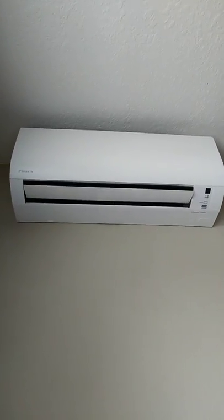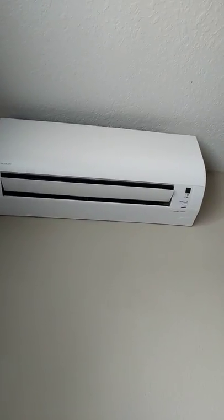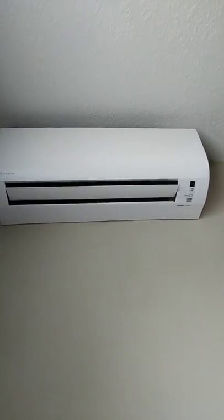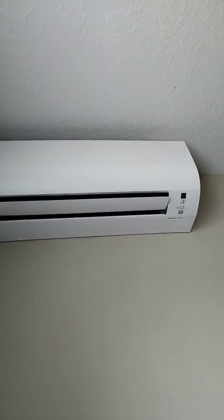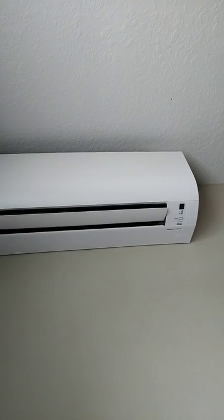This is Mike. When we built this home, we built it with mini splits throughout — we have no ducted central AC, but we have a ductless mini split in every room. In doing this, we had to factor in ventilation because the home is built to 2014 code. The windows had to be impact-rated, low-E, so there's very little infiltration through the windows. It's a block home, so we installed two spot ERV units.